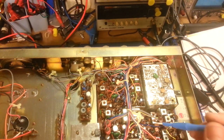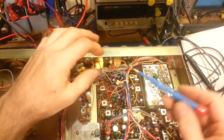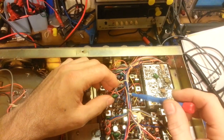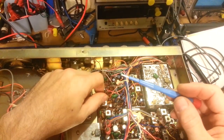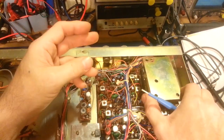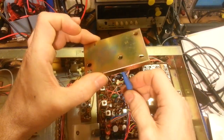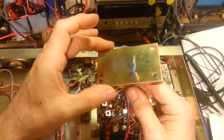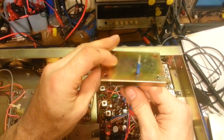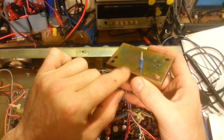The main problem, like I was saying, is bad solder connections, and unfortunately they're not easy to fix. It's almost easier to show you when I solder it. Here's a perfect example - we'll use this shield which has a hole in it to represent the circuit board. It has a terminal that basically passes through it, soldered on this side and soldered on this side.